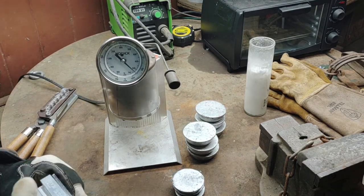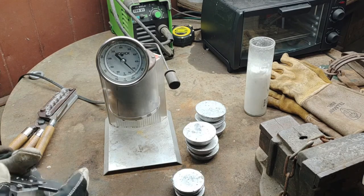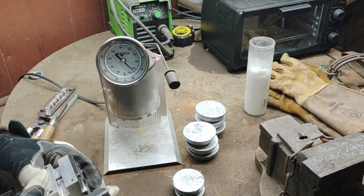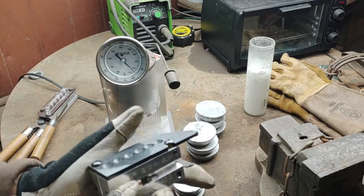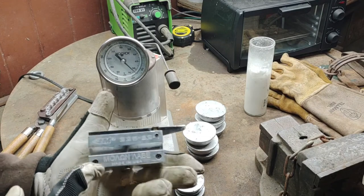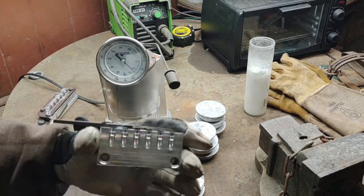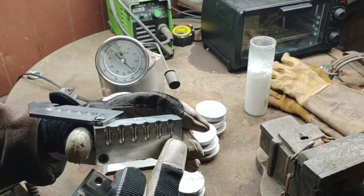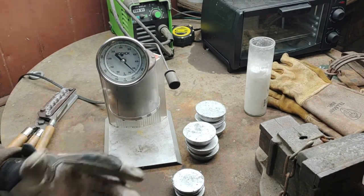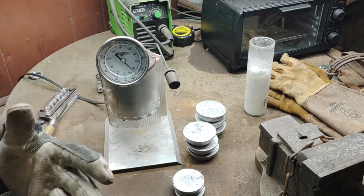For molds, I have two options. I have a 1-in-7 twist AR barrel which really prefers heavier bullets, the 60 to 70 grainers. The first mold I really like is the HM2 225, a 62-grain six-cavity mold — kind of a hard mold to get. It has the Molon Labe engraving, made in the USA, and it's a longer semi-flat-nose bullet. I got it off a guy for like 30 bucks. But since a lot of casters might be watching, I thought I should use something everybody can get.